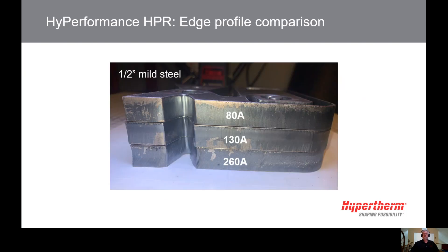In the end, the best amperage is a decision you and your customer should discuss — it may be worth running some test cuts at different amperages. For critical parts with high accuracy requirements, if cutting at the next lower amperage improves details on a critical feature, it may be worth the increase in cutting time.